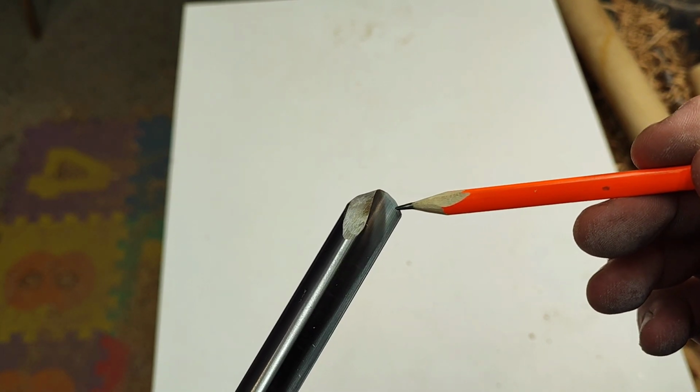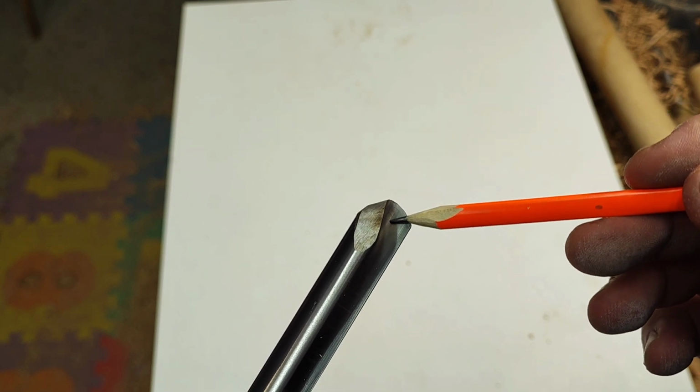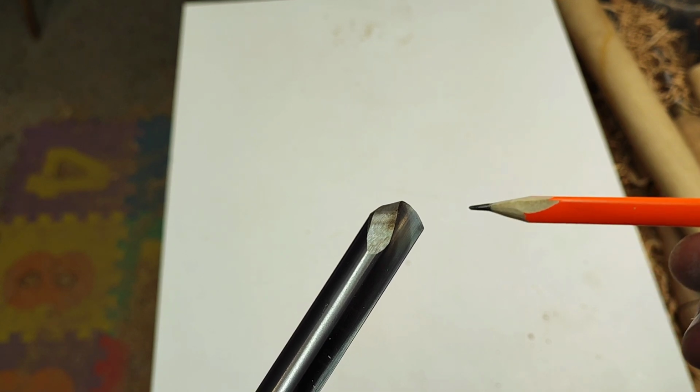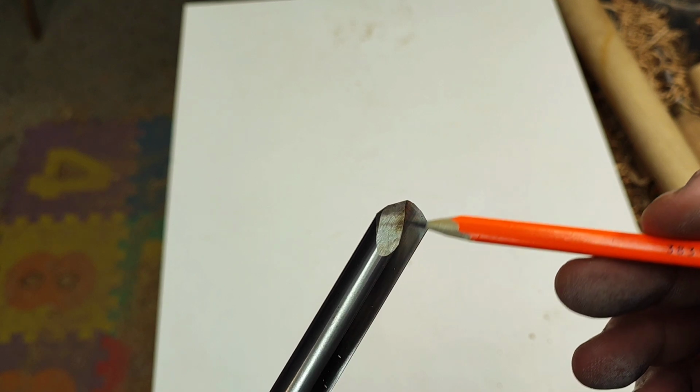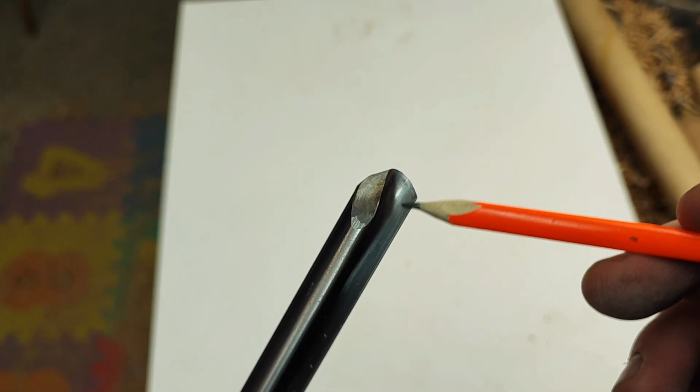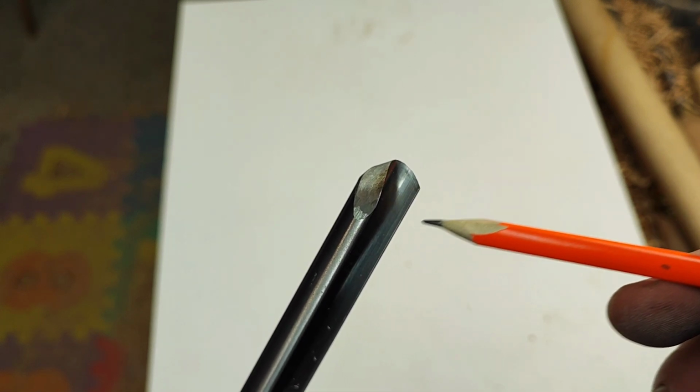But I find that if you have a shorter wing like this, or even up to 40 degrees as Baptist suggests, it is great for hollowing. And the left wing, the longer one like this, is much better for hugging the outside of the bowl, shear scraping and stuff like that. So there is no reason why you cannot sweep back the right wing. I just prefer it like this.